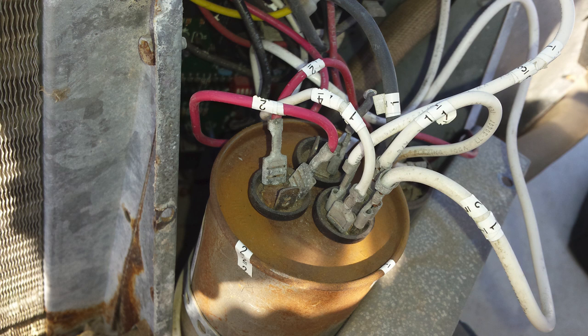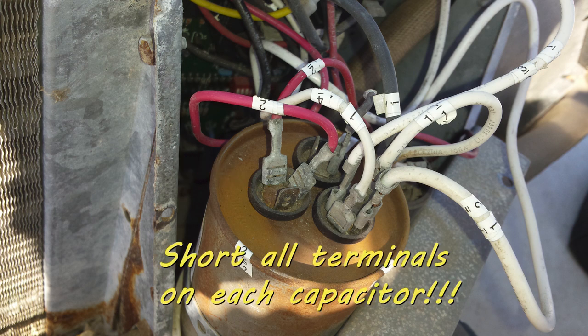One of them is, of course, you need to have the circuit breaker turned off to your air conditioner unit before you ever start working on it. Second, there is a way to short these capacitors — it's as simple as taking an insulated handle screwdriver and touching the screwdriver to the terminals and then to the metal frame you see there. That will drain the energy off of it safely so you can work on them safely. If you are not familiar with working with this equipment, I highly recommend that you go and find somebody that is, because you don't want to be messing around with these voltages.